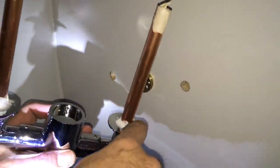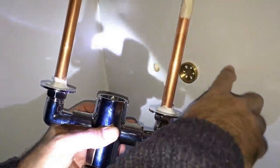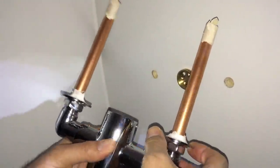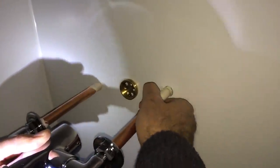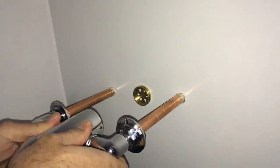I've just put a little bit of Sikaflex on the back of these flanges just to seal those penetrations, and put a bit of masking tape over the copper pipes because I don't want any sawdust or anything getting into those and then getting into the mixer.